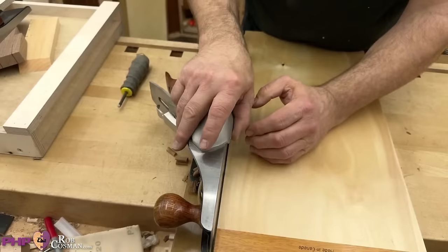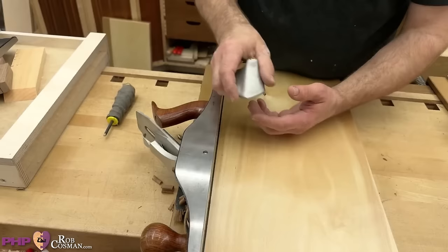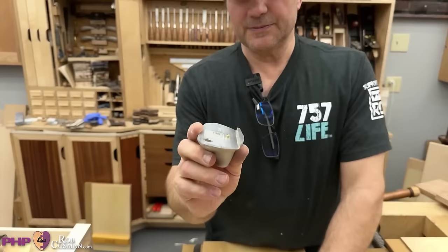And then you can go over to your... The best way is to go to your drill press, put in a 1/4 inch drill, and go down about 3/16 inch in depth. Then you're going to wind this back down, and it's quite a tight fit, so you don't have to worry about that wiggling loose. Extend that all the way out, and then you come along like so, and then drop it down in.